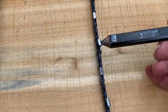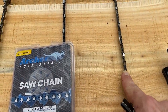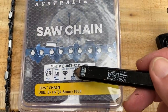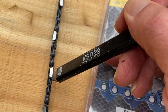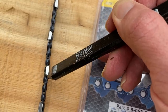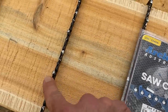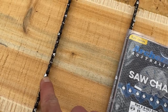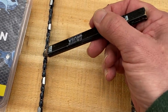This one I just bought — I couldn't get the chains I like best because of COVID back-orders — so I found this one for really cheap online. It does say it's a milling chain, and it's a semi-chisel sharpened at around 15 degrees instead of the normal 30 degrees. You can see this edge has just a little bit of an angle — not straight across and not that normal 30-35 degree angle. I haven't tried this one yet, although I have sharpened regular semi-chisel chains down to less than 30 degrees — I've gone from 0, 15, 20, 35, everything, just to see what worked the best.